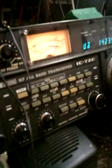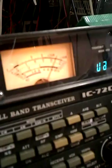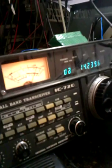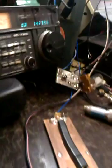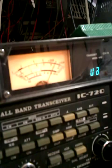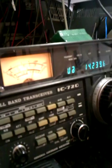Modulation is SSB. I will have a final stage when it's finished, covering two bands — 14 MHz, which we're using now, and 28 MHz. The receiver input stage has a band filter, inductively coupled to the antenna. After that is an RF amplifier with a high-frequency transistor, then the first RX mixer SR641 from old military equipment, followed by a crystal filter also taken from old military equipment.